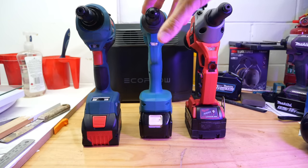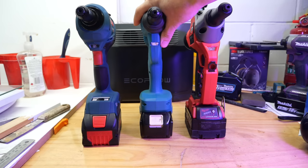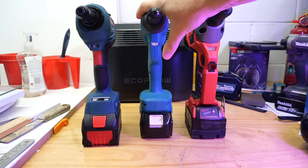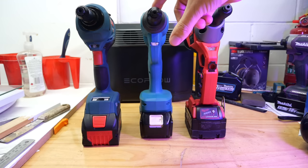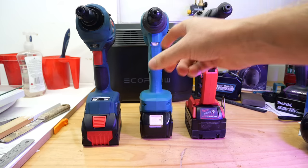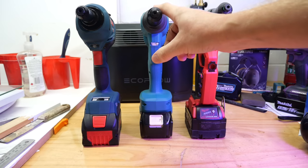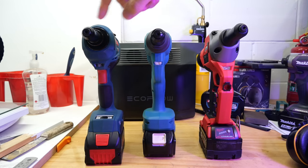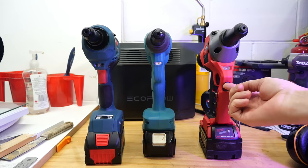The difference between the DRV 250 and the DRV 150 is that the 250 is a little bit slower at pulling so that it doesn't snap your rivets at the wrong time or put undue pressure on the tool. The 4.8 millimeter tool will go faster, but the 250 can apply a lot more force. So if you're doing small rivets all the time and want speed, go with the 150; if you're doing small ones occasionally but big ones most of the time, you're better off with the 250.